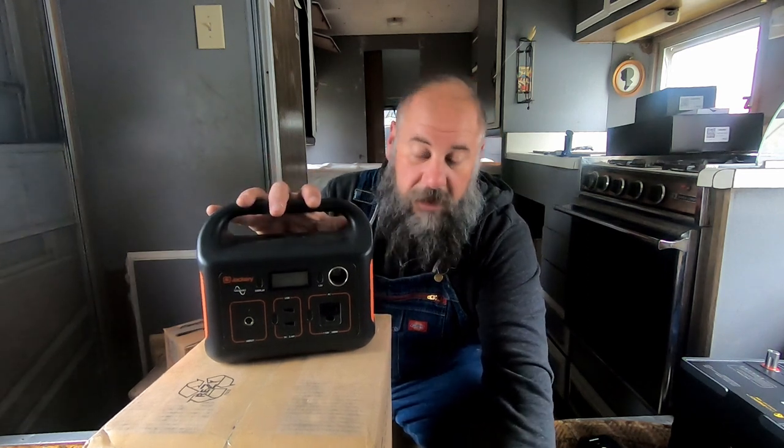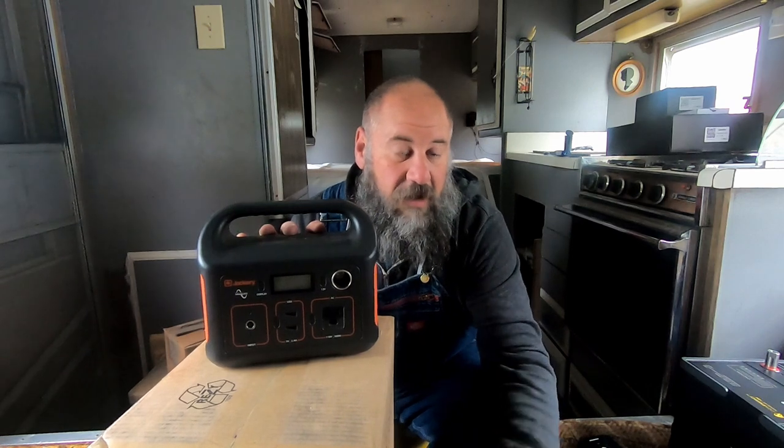After these reviews, I'd really like to check out the new 1000, which is the answer to my biggest gripe about these types of systems. These have a PWM controller in them and they're just kind of slow to charge. That's the biggest thing. Sometimes if you don't have enough power going into them, they can't sustain your life on a daily basis because you just start pulling too much power out.